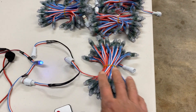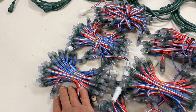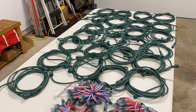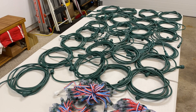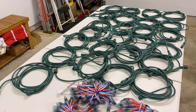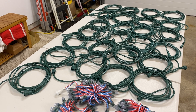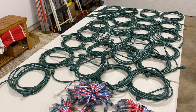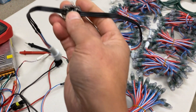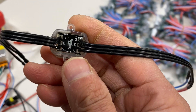I have bundles of 50 pixels — 50, 100, 200, 300, and 350 pixels that we'll use for all the testing. In addition, I have 25 bundles of 10-foot extension cables, making a total of 250 feet. It's not likely you'll be driving a pixel prop more than 250 feet from any controller or chained off from another prop. All these wires are advertised as 18-gauge, though they're a little thinner than true 18-gauge — typical of industry materials. I also have an F-amp from pixelcontroller.com with pigtails soldered on. This is version 1.01.